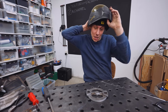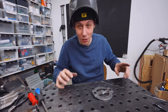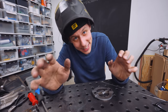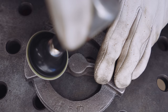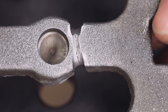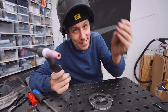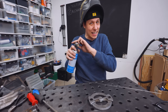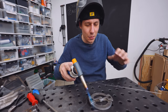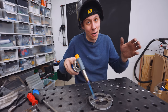I've got all my stuff set up and I'm going to attempt to weld this piece of cast iron. I've never done this before, and from what I've been told, welding cast iron isn't necessarily the easiest thing to do. So I've done everything I can to make sure this ends up with a good result. First off, I've filed the entire area to make sure everything is nice and clean and to give me somewhere to put the weld bead. I'm going to attempt welding it with some 316 stainless steel filler rod, and last I'm going to heat up the entire part so the metal doesn't build up internal stresses and crack.